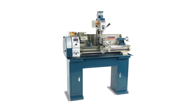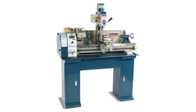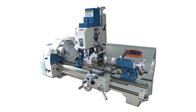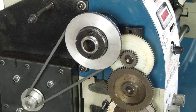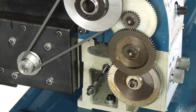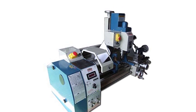The Bailey MLD 1030 mini lathe combo is 19.6 inches in length, 11.8 inches in width, and 16.1 inches in height. Including all the parts, it weighs 66.14 pounds. Because of its small features, it is very convenient to use in many workshops. It is constructed with a 150W motor that can provide variable speeds — a total of 15 variable speeds ranging from 500 RPM to 2500 RPM. The whole machine needs 120 volts with a 50 Hz frequency. It has 10 levels of milling and drilling variable speeds from 500 to 2500 RPM. The vertical stroke range of the milling and drilling is 60 millimeters and the drilling capacity is 6 millimeters in depth. The milling and drilling head can be rotated up to 360 degrees. With a 3/4-inch diameter spindle bore, the lathe machine can provide 5 levels of speed from 560 to 2500 RPM. The working capacity is 7.08 inches or 180 millimeters with a stroke of 18 millimeters. The working table length is 85 millimeters and the T-slot width is 8 millimeters.